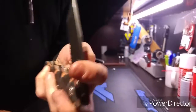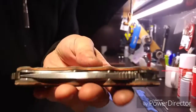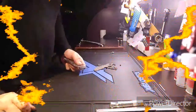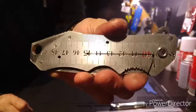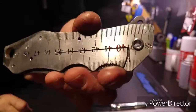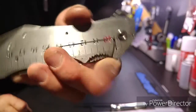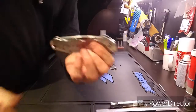A little bling. The budget — I had to make this and those liners out of something, and here comes the most impressive part. I used an old metal ruler, hardened stainless steel. It was easy to drill, no problems there, easy to cut and grind down, and it's very springy and it holds the shape of the spring. The liner lock switches into place just perfect, and it's just what you have lying around the garage.